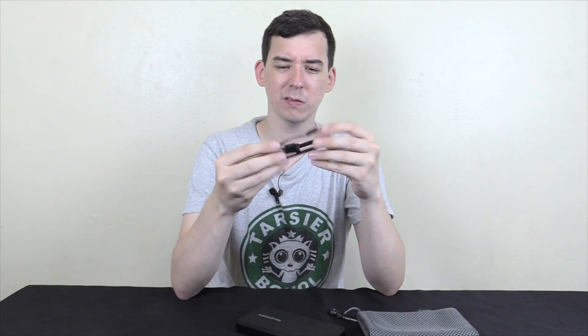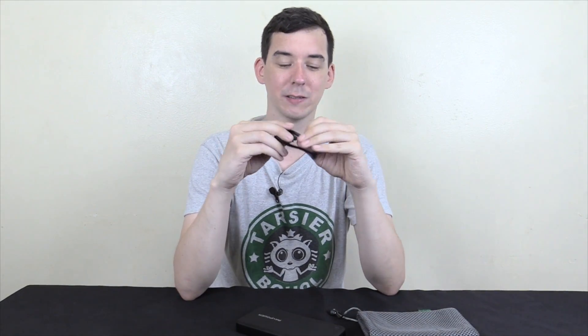You might think it's just another micro USB cable. It's a flat cable so it doesn't tangle, but these are not your average micro USB cables — these are high quality, using nice thick wires inside. What that means is you can charge your power bank nice and quick. If you use a generic cable, especially a longer one, you might struggle to charge this quickly. My advice: use the cable they supplied. It's short for a reason — it's going to charge your power bank much faster than the average generic long cable.